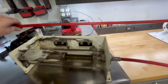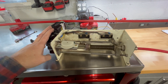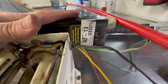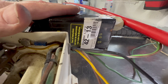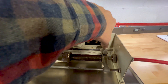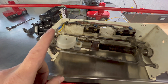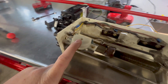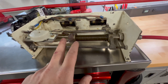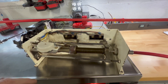The other downside is probably the complexity. I see a lot of people mention these units go bad, but there's really not a lot here that can fail. Parts are pretty easy to find — like I mentioned, an old GM window motor. For the end limits, these are very basic micro switches. For the potentiometer, I used one off a fuel gauge — get one with the resistance that matches your trim gauge. I'd be surprised if you damage any of this bigger mechanical stuff in there — it's all pretty robust. This one's been maintained through the years and functions great.